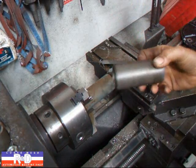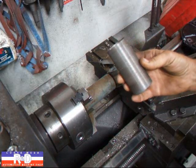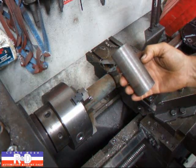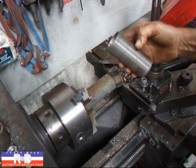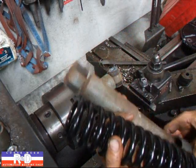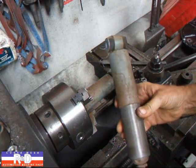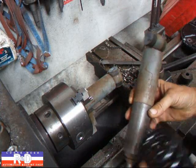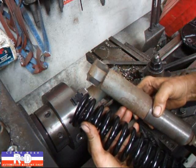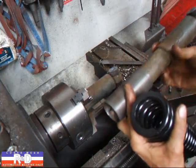Now this is something I've already made up. This is a piece of pipe that I cut so many threads per inch on there. And I'm going to use this to be able to adjust the bottom of my shock. I'm going to cut this in half so I don't need the whole thing because the spring isn't going to have to get that far wound up. So we're going to show you how this is done.